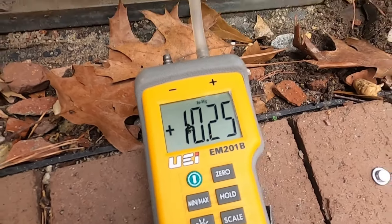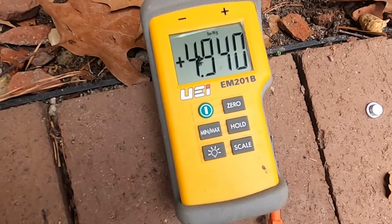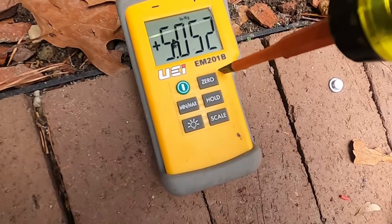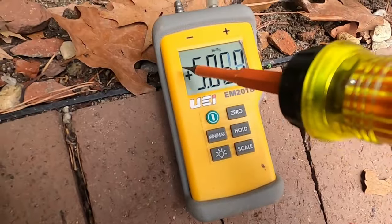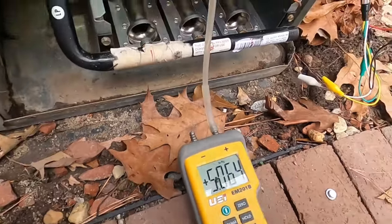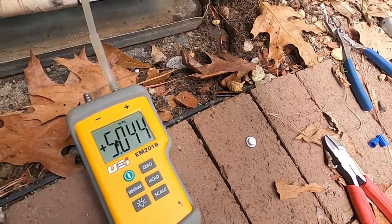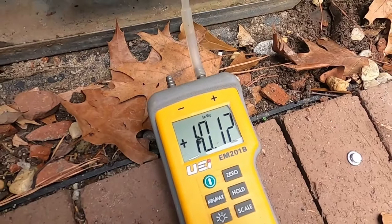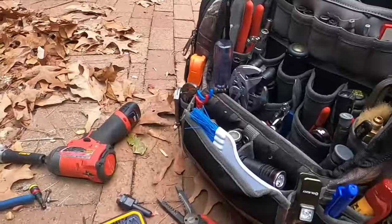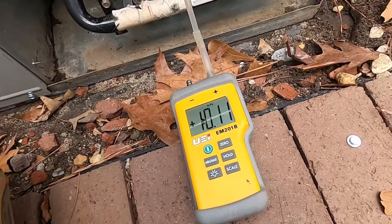Not a problem here — just need to adjust the low setting a little bit. I think they're going to be just fine. It's just batteries, guys. A lot of guys use these UEI manometers — there's no battery indicator on it, and when the batteries get weak it'll start throwing pressures off. That's a good indicator: check your batteries before you jump to a conclusion. Always make sure your equipment's batteries are fresh, and watch for corrosion. If your equipment is giving you bad information, you're going to put out bad information — and that can be bad.